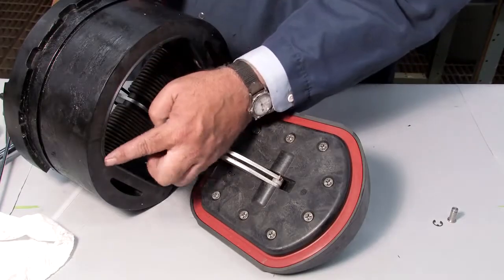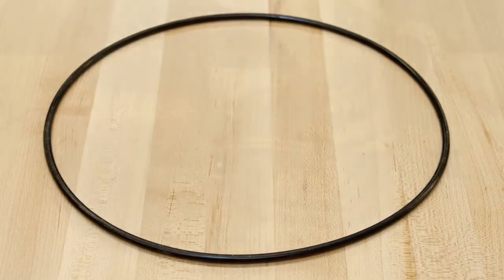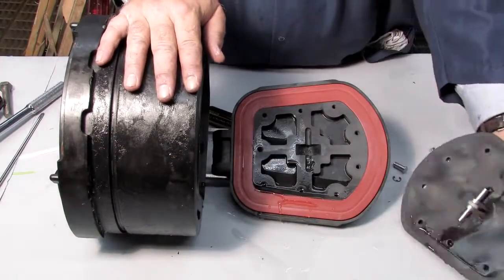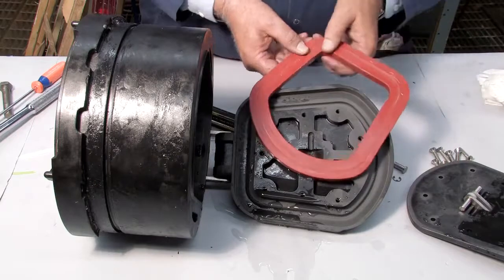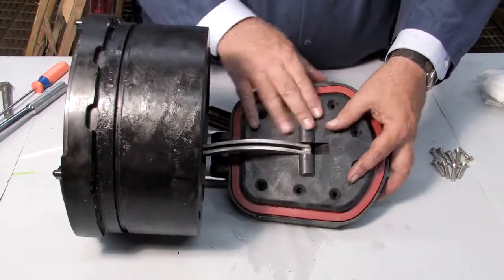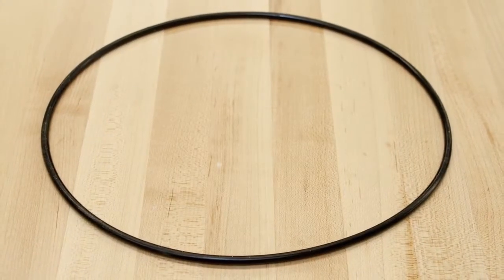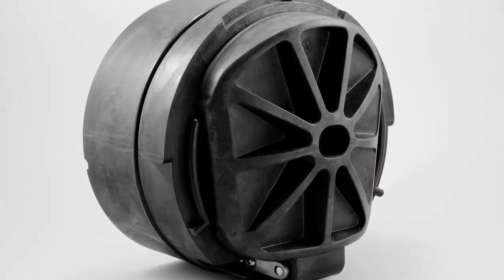Closely inspect all parts of the check, including the check body, the check clapper and sealing surface, the rubber sealing disc, and the o-ring and o-ring groove. For closer examination of the rubber sealing disc, the keeper plate can be unscrewed and the sealing disc carefully removed with a flat blade screwdriver. If one side of the disc happens to be cut or torn, the disc can be reversed and reinstalled in lieu of ordering a replacement. If both sides are damaged, it should be replaced. Inspect the o-ring — if it's damaged in any way, it should be replaced. With all parts of the check cleaned, inspected, and replaced as needed, begin rebuilding the unit.